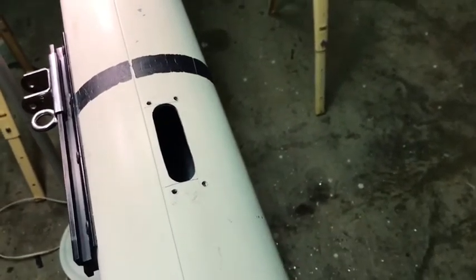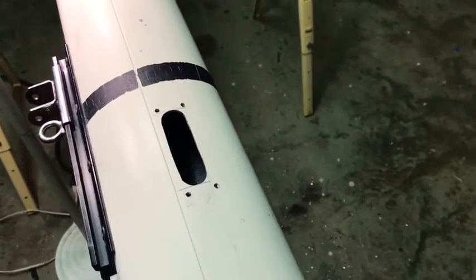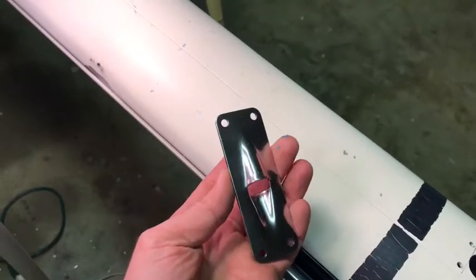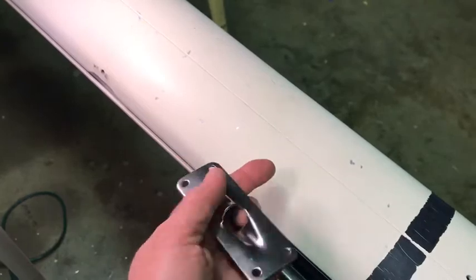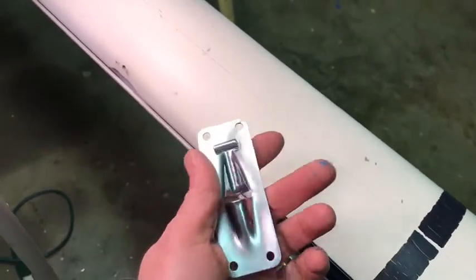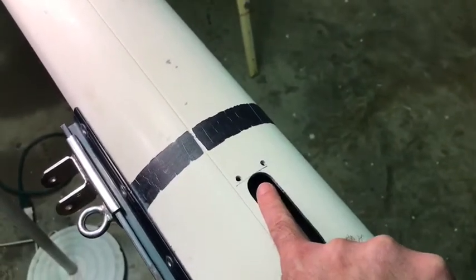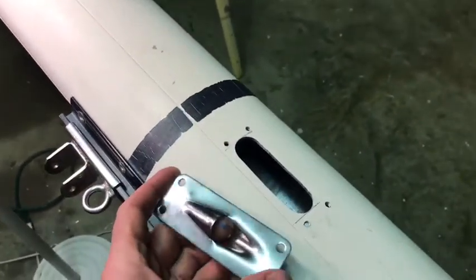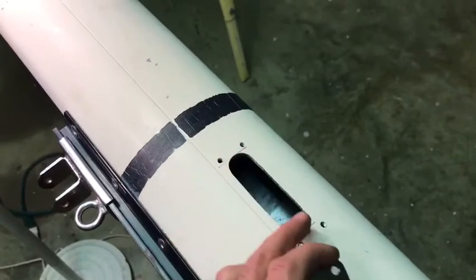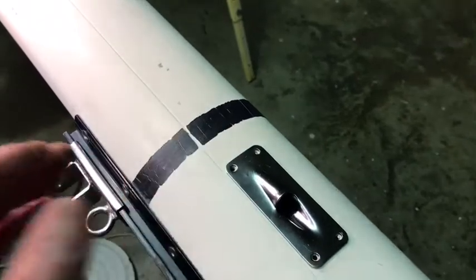I cleaned up the hole by sanding the inside with 150-grit sandpaper so it doesn't have any sharp edges. I can't imagine that hole is going to cause any chafing on the halyard. Really simple design — I like that it doesn't include any sheaves or require the line to make too many turns. It's got a little guard at the top to prevent the halyard from rubbing on the inside of the hole in the mast. Cut a big hole, drilled and tapped four holes to mount it, a couple of screws, and the project is complete.